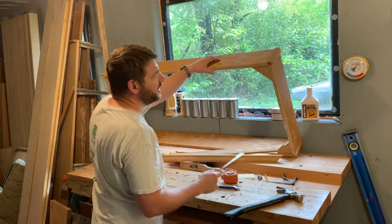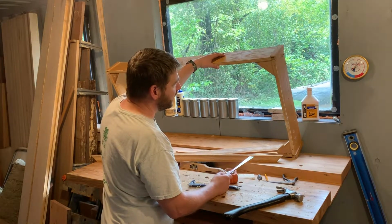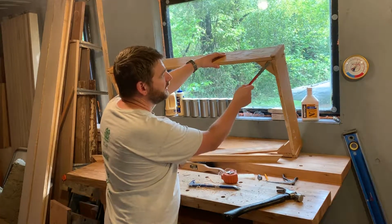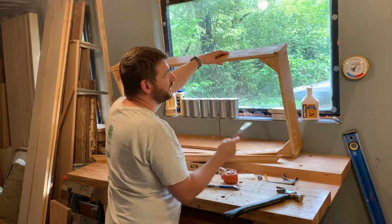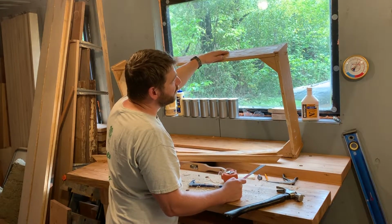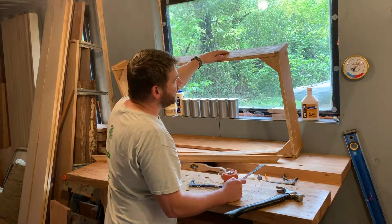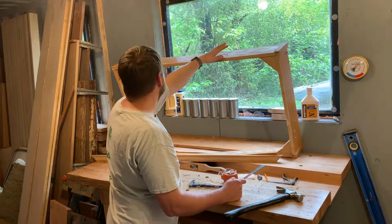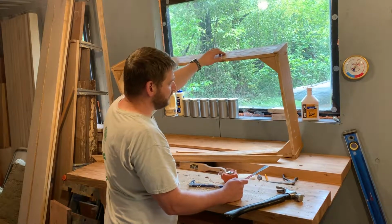Interestingly, on the construction here, it looks like they actually cut this box a little short, maybe to begin with. It has corner gussets, which is great, that's pretty well a must. But they've got filler blocks inside here behind these little 90 degree moldings, and that kind of sucks because that means that's that much material we actually don't have to work with. So we'll see whether or not we can still use it, but I suspect that the person doing this didn't really have a great idea of what they were doing, because this is very basic woodworking.